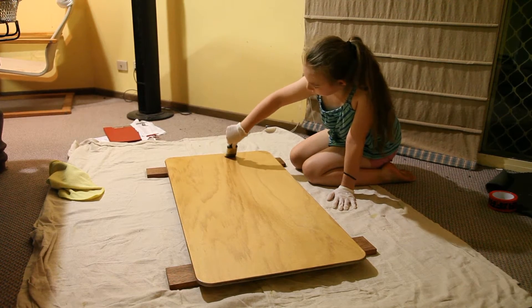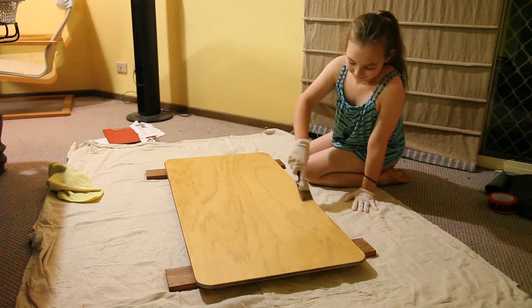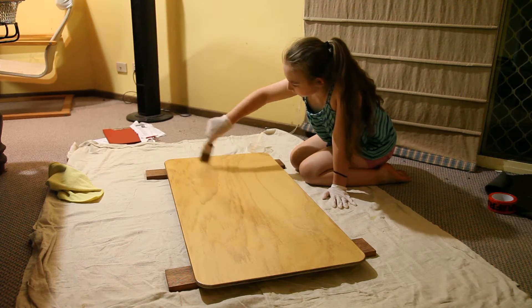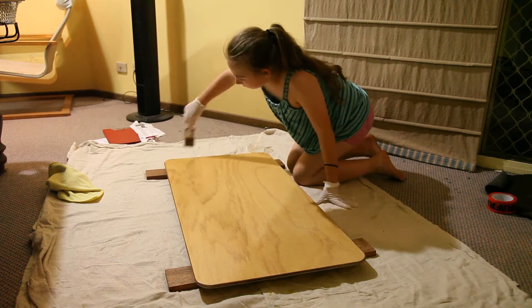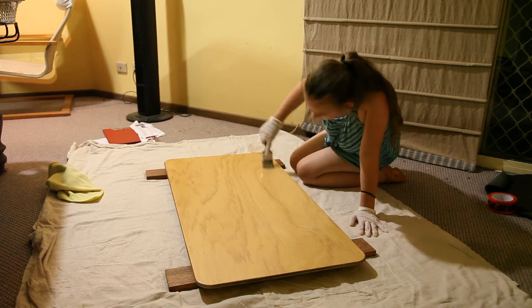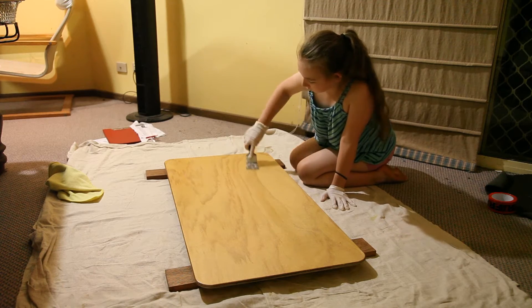Welcome back - we're doing the first coat of epoxy resin. This is the boat coat, a two-part resin and epoxy with the additive TPR-DA, which is a thinner as well as a rot inhibitor. They recommend this as a first coat so it soaks in and helps to preserve the wood, after which you apply two more coats of the boat coat two-part epoxy resin proper. We're doing the first side of the table and then we'll flip her over and do the other side.